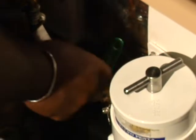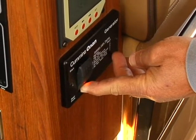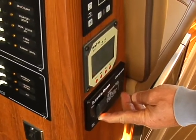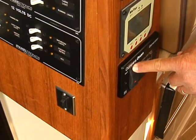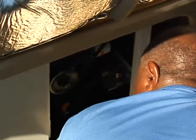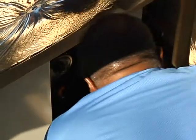I realized as we tried to start it that I made the major faux pas of not turning the valve on. Hit the primer side of that switch — that's the lower side. You'll hear that pump cycling. When it gets consistent, we should be good. Now we can go ahead and try to start it again. That takes care of that.